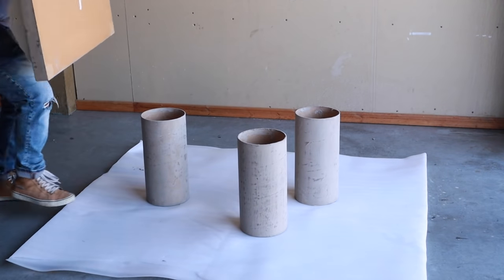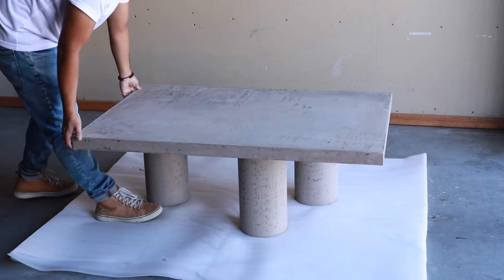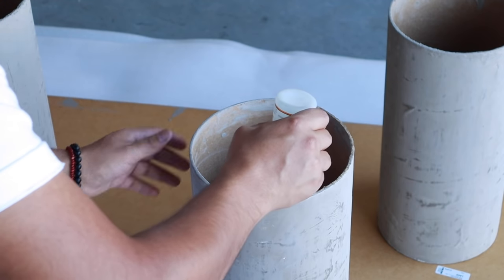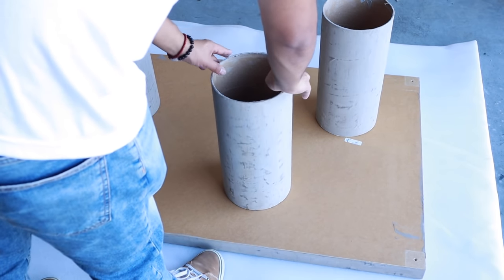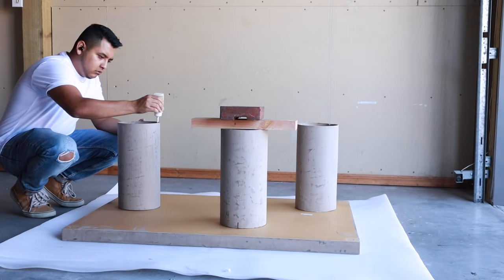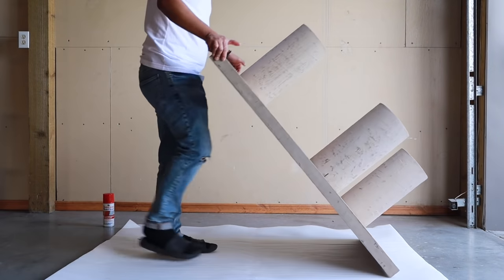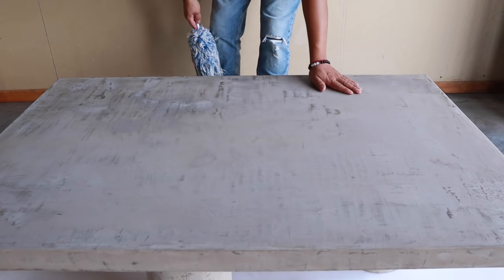This is not everybody's cup of tea, and I don't know if it's mine either, but I love trying out new techniques — things I wouldn't normally gravitate towards. This is more of a really postmodern table. I'm not sure what the best glue would be, but I ended up using Gorilla Glue to adhere the cylinders to the tabletop, and it worked just fine. I applied a good amount around the edge, flipped the table upside down, and placed them — not randomly, because we don't want it to tip over. I see a lot of postmodern tables with three legs in this style. Then I put heavy objects on top to clamp it while the glue cured, which takes about 24 hours.